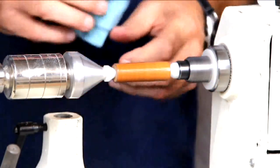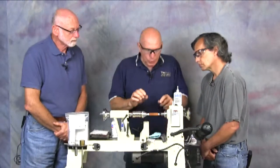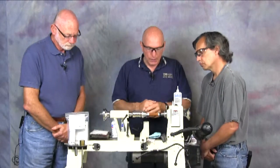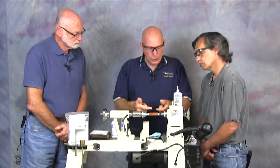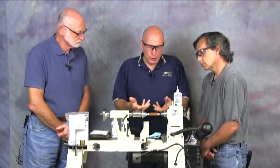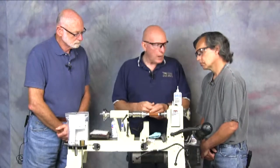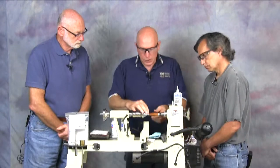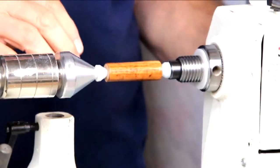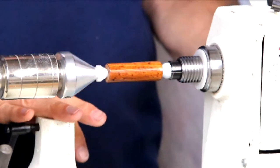Now these plastic ones at the end — what are those about? Those are actually bushings. When you finish a pen it's turned down to match the bushings on your mandrels, and if you finish with regular bushings the glue sticks to them and ruins them. These are made just for applying this finish — the glue will not stick to those. So now that we're finished, you just pull that piece right off. The glue doesn't stick, it comes right off. And it's hard now, ready to go, totally finished.